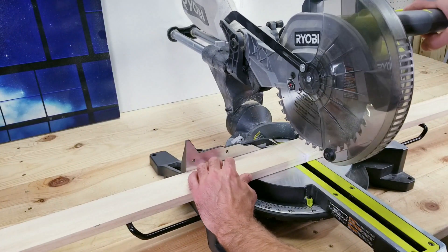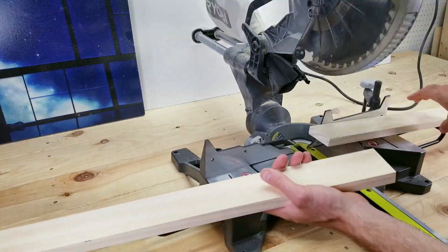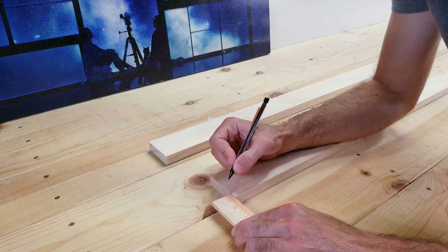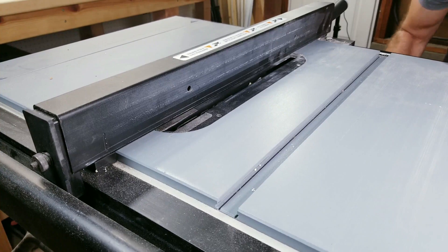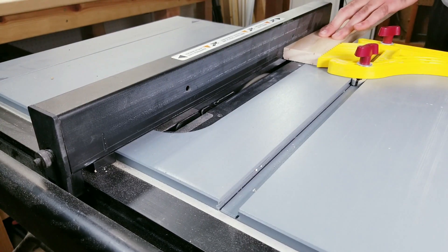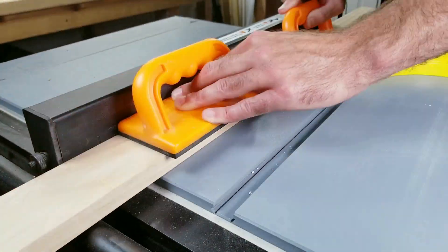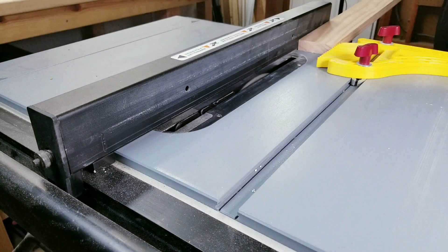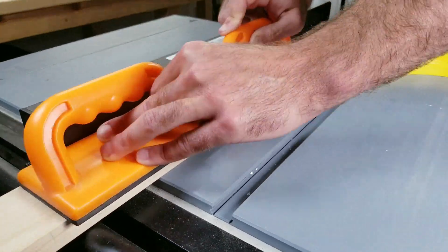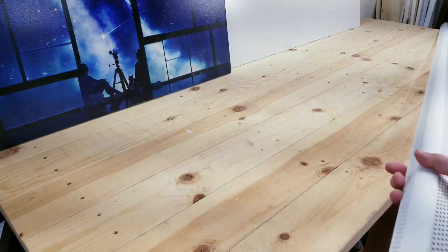For this project I went out and bought a 1 inch by 3 inch by 8 foot long board. To make things easier to work with, I'm going to cut it in half so I'll have two 4 foot long sections. Next I'm going to make a mark on each side that's about 3 eighths of an inch from the edge. I'll be raising my table saw blade up to about 1 eighth of an inch and cutting a channel in the wood at those lines. It should now look similar to this.